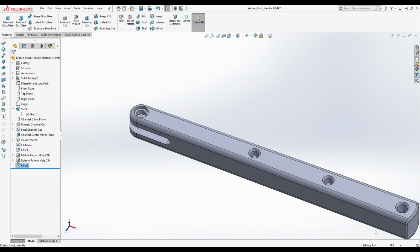Because if it's too large, and maybe I should wait until I have it modeled to explain this, but it would be contacting the two raised sides, but it still wouldn't be moving. So you'd want to find the smallest size drill that doesn't roll around or rattle or anything in there, and it would probably be an eighth of an inch. But if you wanted to be extra sure, you could put some Prussian blue or something in there and slide it back and forth and see what is getting scraped off. If it's just the points, then it is too large of a drill, right? But let's get this modeled, all right?